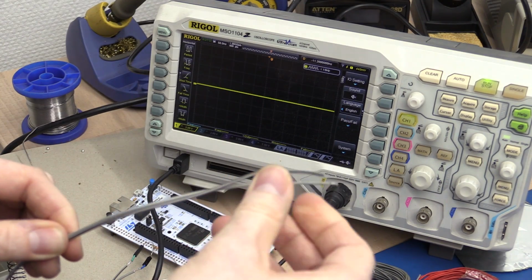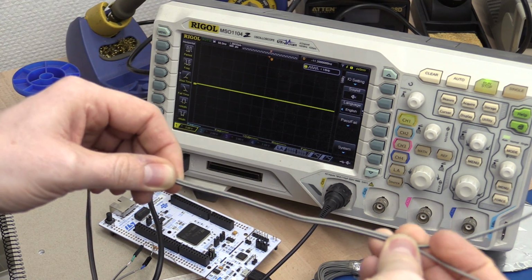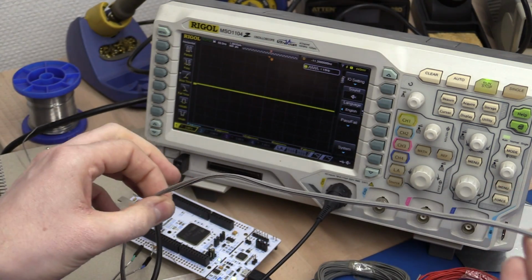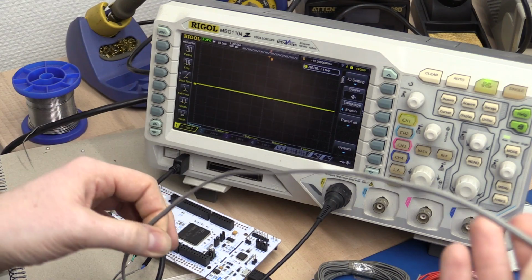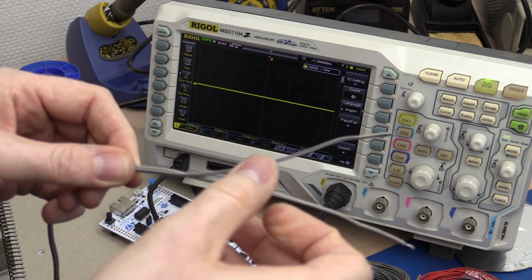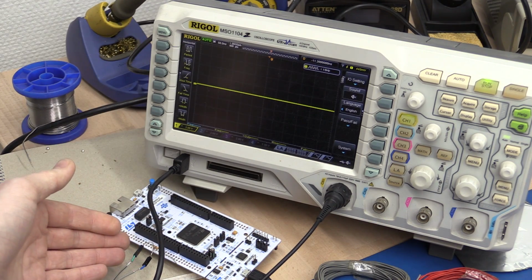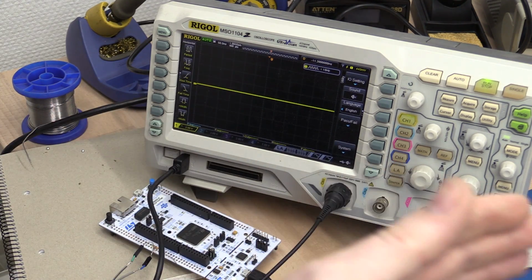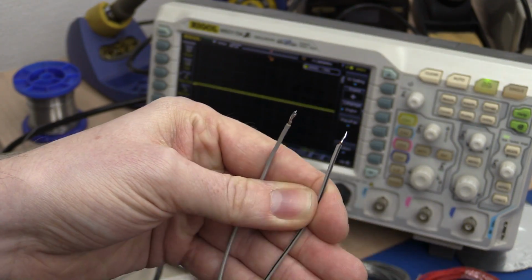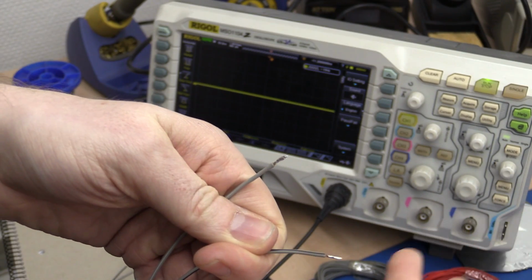The funny thing about that is, if it's a completely uniform transmission line, which never happens in the real world, but theoretically, if we have a completely uniform conductor and the surroundings are completely uniform all the way along the cable, it doesn't really matter how long this cable is, it will have the same characteristic impedance. And for the transmitter, it will look like an infinitely long transmission line if it's terminated with the right load at the end here. And we'll get no reflections because all the power will be dissipated in the load.